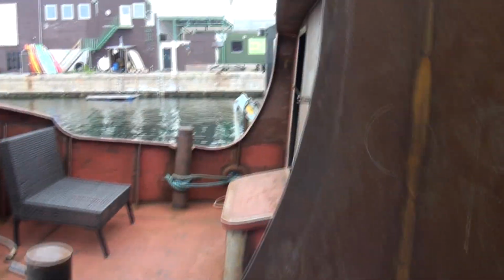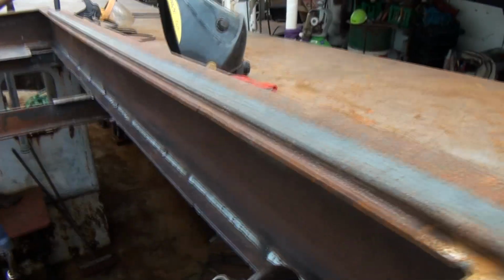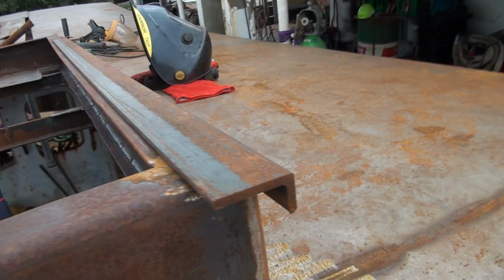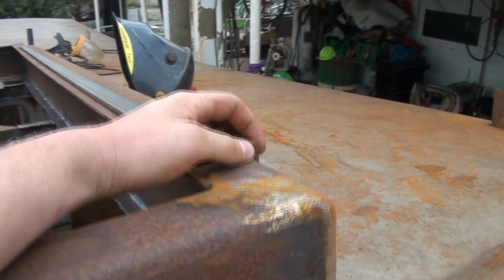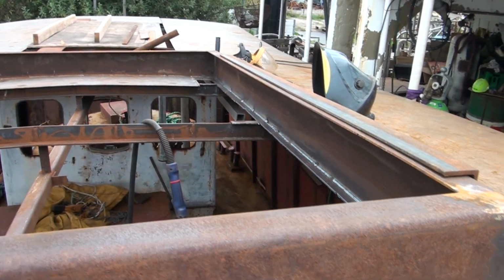As you can see, there's now a small frame welded on top of the roof. I'm just getting closer to show you. So these used to be rectangular beams, and I've cut them in angles, and I welded it on. And the idea is that I will make a frame out of these angle irons that goes all the way around, and then sandwich some rubber in between, and then I will be able to bolt on the new wheelhouse and also take it off if necessary.